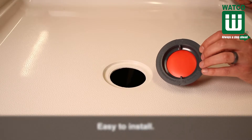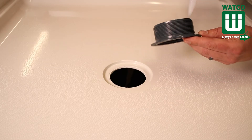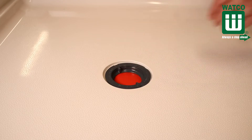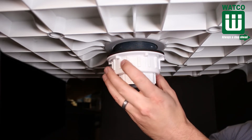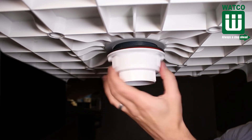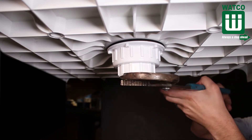It's easy to install the WACO Innovator Shower Drain. First, apply silicone to the underside of the top piece flange. Drop the top drain piece through the top side of the shower base hole. Compress the top piece. Underneath the shower base, place the black rubber gasket over the top piece barrel. The black gasket will sit against the bottom of the shower base. Slip the orange plastic slip washer next to the black rubber gasket. Screw the bottom receptor into the top piece.